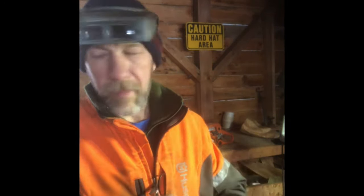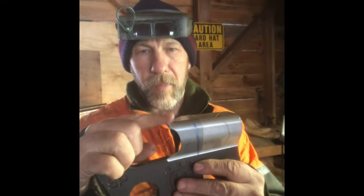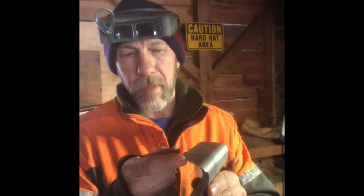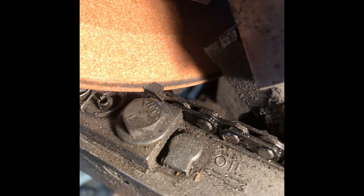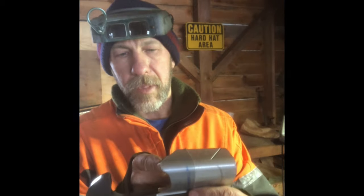When I just mentioned the shadow line idea, that's primarily on the side plate. On the top plate you tend to get a little bit of flaking. Understanding how a tooth is made: we've got soft metal and then the chrome on the tooth. As that edge becomes sharp, what I see is just an ever-tiny little bit of flaking of that chrome on the top edge, and then I know I'm done. On the side, you'll see that little shadow line, and because of the way the stone strikes the tooth it tends to clean that side plate right off nice and clean, giving you that little bit of flaking across the top plate.